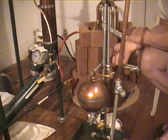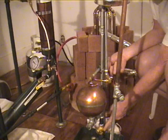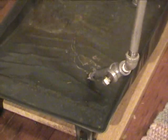It's dropping. It's down to 4.5 right now. Just going by the sound of the clacker. That's this valve. It's the top one? Yeah, I think so. That one's cold. Ow. I think it's hot. Staying at 4.5, oh, it's going. I can't feel it. Well, the boiler seems to be keeping up with more to 3 to 4 psi. So that's the equilibrium right there. Yeah, I think so. We'll find out. Do a few more cycles. See, that's what causes the pressure loss when it goes. So I'll try to catch it on the first one.